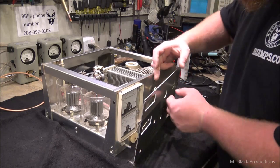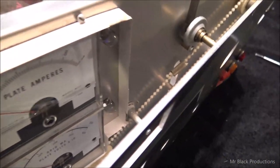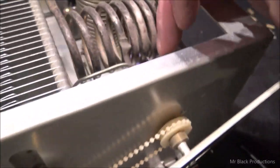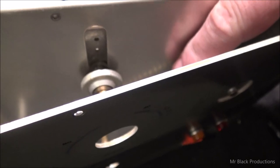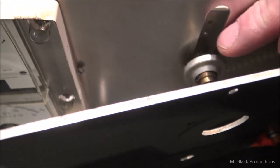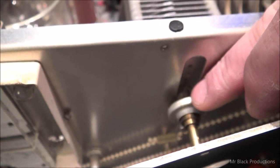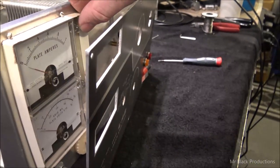This is our little clutch mechanism here. This is really neat — this is your band switch. So you have your output band switch, and then through a plastic chain drive system you've got your input band switch, which is down here in the bottom left-hand corner. There's no sag, there's nothing on those — it's in beautiful shape. What we're after today is this clutch — I've got to pull this out and work on it.